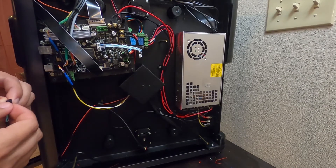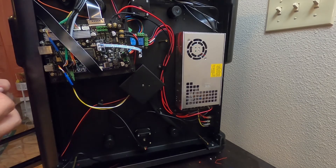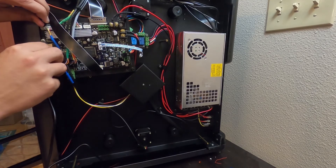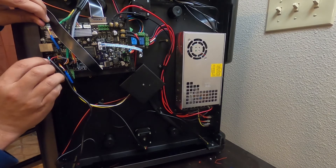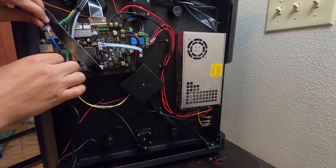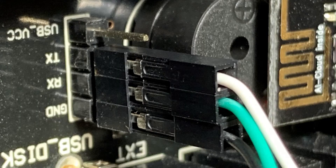If it can't talk to your printer, one of the biggest culprits is that you might have accidentally mixed up your RX and TX wires. At the end of this video, I've shown you exactly how it needs to be hooked up for it to talk to your printer. If you use knockoff USB TTL cables, just know that once you plug that in, one — it won't talk, and two — it also blacks out your screen on your Qidi X-Max. So make sure you plug it in the way I've shown. Also, don't hook anything up to the VCC. Once you boot everything up, make sure you turn the printer on first, then turn on your Raspberry Pi.